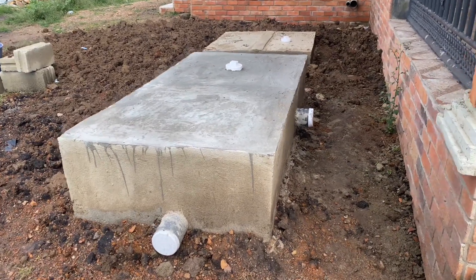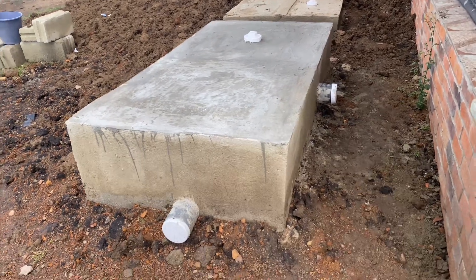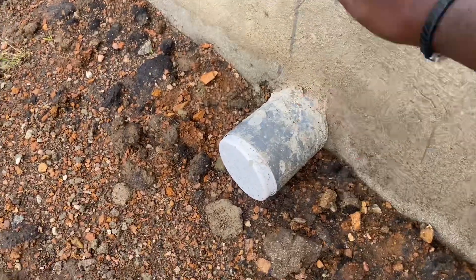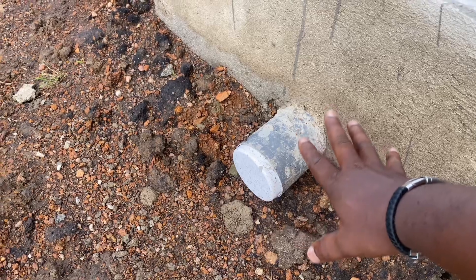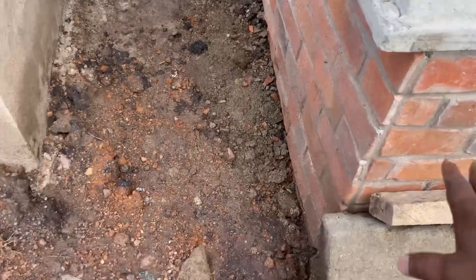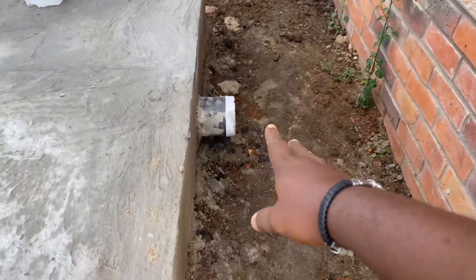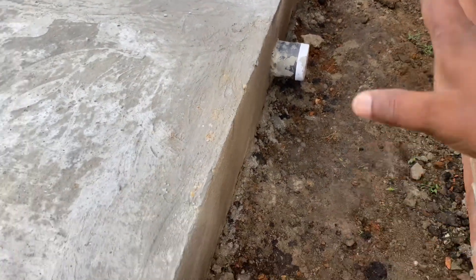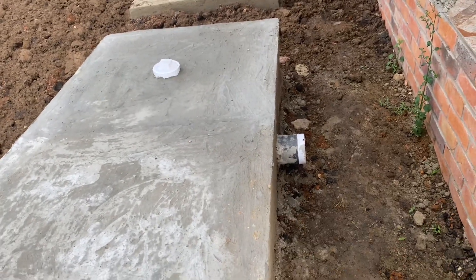I'm showing you the completed work. This is how the biodigester ideally must look when doing it for a waterlogged area. The key part is that your inlet will have to go down. The space between the digester and the first inlet is not that large, but that's what you get. We are separating it so that only one pipe goes into this side, and the other pipe comes straight into a separate inlet, so the waste will be at separate places in the digester.